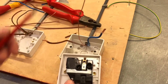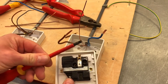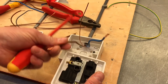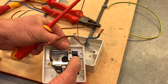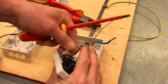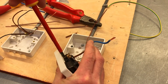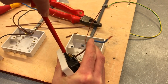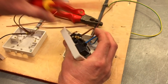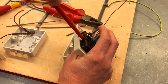We'll come back to the CPC in a moment. To connect these correctly, remember to use the electrician's screwdriver — not the terminal screwdriver — you won't get them tight enough otherwise. Put the brown line conductor into the terminal marked L, and the blue into the terminal marked N for neutral. Push each one fully into position, hold it down, and tighten the screw nice and tight using the electrician's screwdriver.